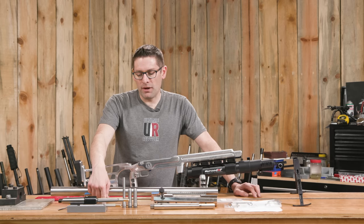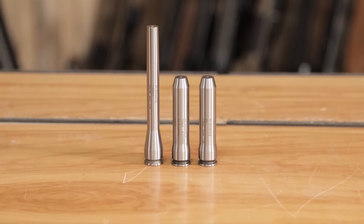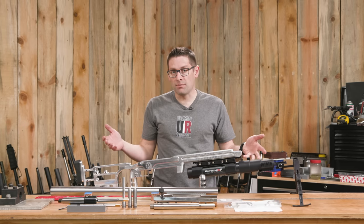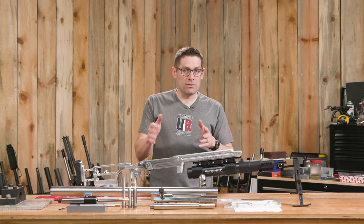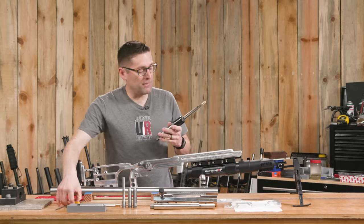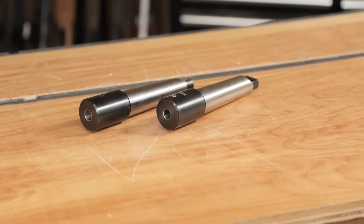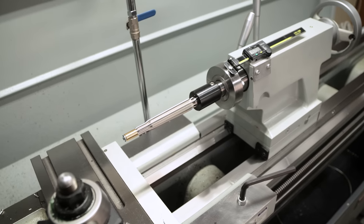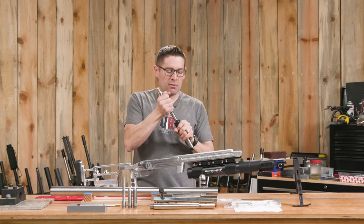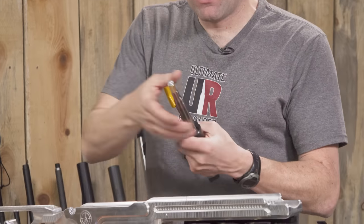I'm deploying the big guns for the lathe on this. I'm using Treble tooling — we've got a go and no-go gauge, a freebore gauge, and a .50 BMG body and neck reamer plus a separate throater so I can pick the freebore I want and custom tune this to specific bullets. I'm working with Bruce Thom over at BAT Machine for recommendations. I've also got my rigid reamer holder made from a tailstock blank — Morse taper number 4 for the TL-1660 — and it's machined so precisely that the reamer forms an air seal without an O-ring.